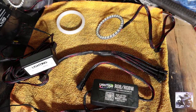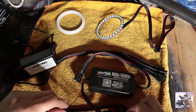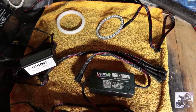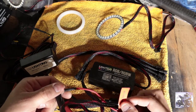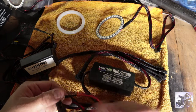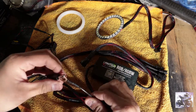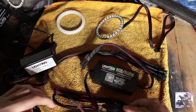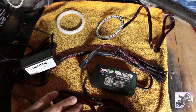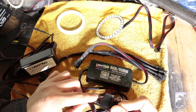Let's get started on actually connecting everything. So you've got your Bluetooth controller right here. It's going to have your positive cable — it even says 'power positive' over here so you can't get confused, plus it's red. And then you also have your negative cable right over here. I already have my power leads connected to light it up, and you've got your fuse inline right there.